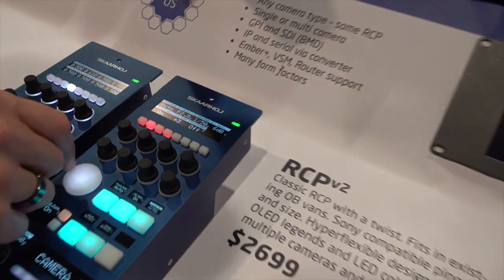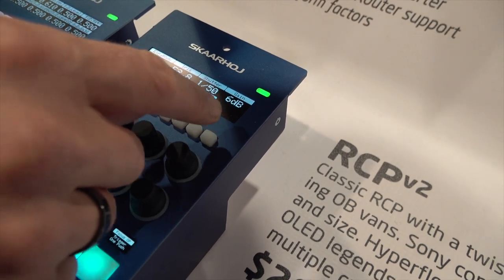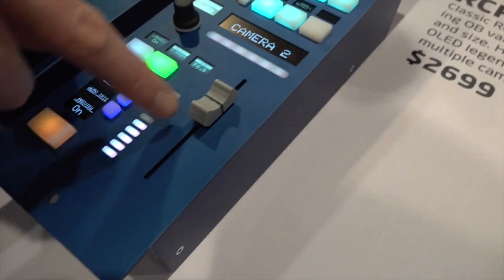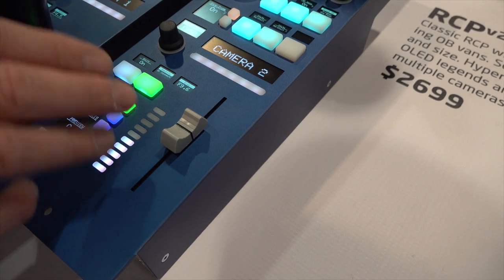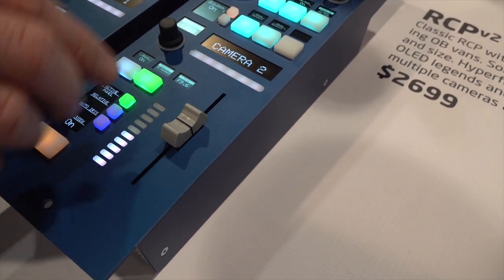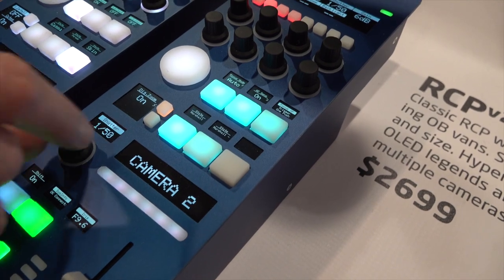We map Visca commands onto the controller, so you can see the exposure mode, which I can change right here — access to iris, shutter speed, and gain. If I adjust the iris up here, you can see it's actually moving the fader, and of course you would use the fader to adjust the iris values. Because the iris is discrete with a number of steps, the fader will typically move in steps — a consequence of having discrete iris steps. The shutter speed is also mapped here.